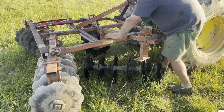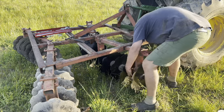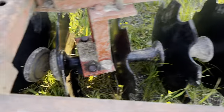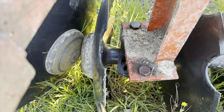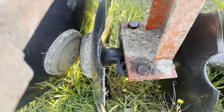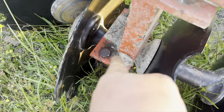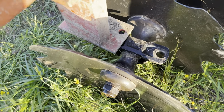I'm running into a problem here — the bearings are not level in the housings and it creates a problem. That housing and bearing lines up relatively well with that drop-down gang, but over here the bearing is not seated in that housing perfectly straight. I think I'm going to get this one lined up, get the bolts and nuts in it, and then work on getting the other one on the right done, and in that process it should straighten it up. I've got the bolts loose so I can pull around some, but it's not lined up because the bearing is not straight.